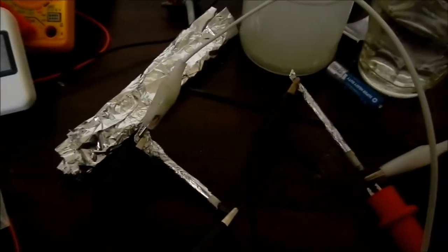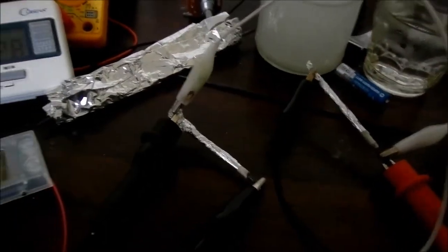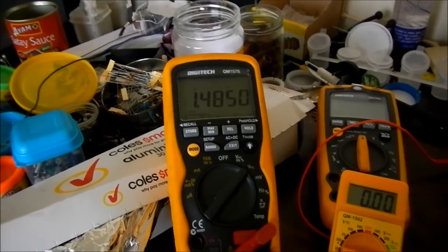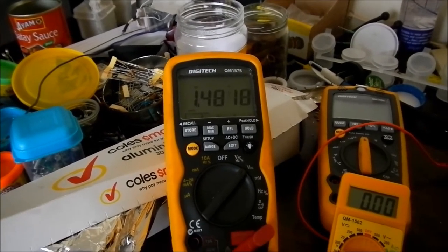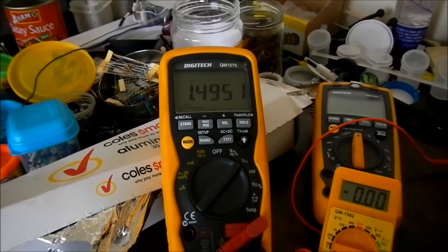That's the cheapest clock battery you'll ever find - not even the full lead from a whole pencil, and a couple of little scraps of foil that you could take off your sandwich at lunchtime. Voltage is going up, not down. I don't know how long it will keep doing that for - I'd imagine days to weeks before it actually starts to go flat. It will eventually eat away the aluminium, but there's not a lot of foil there.